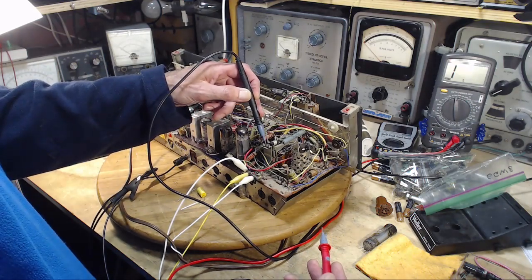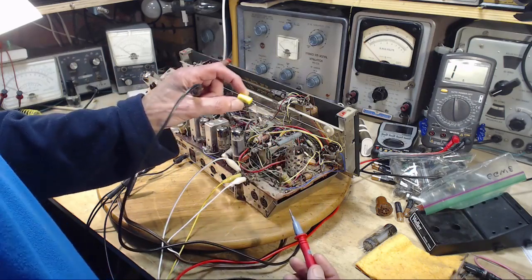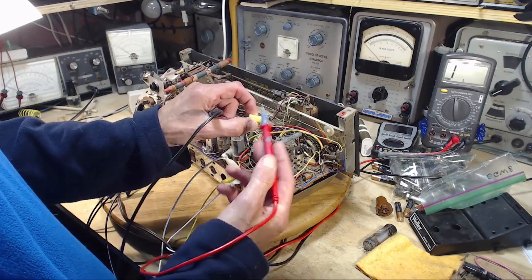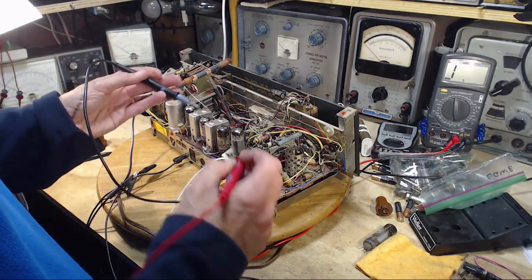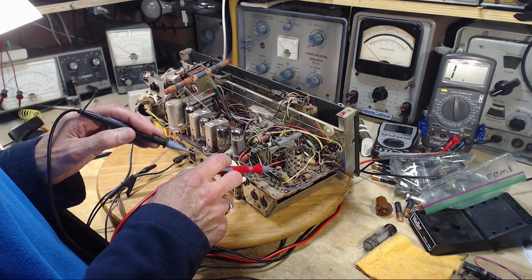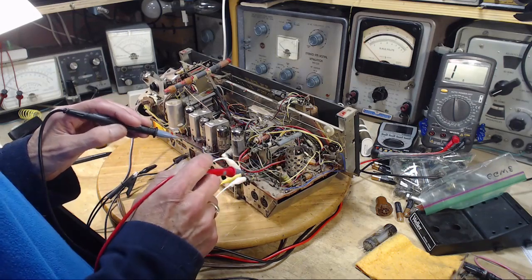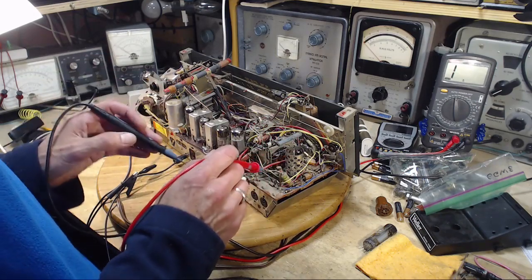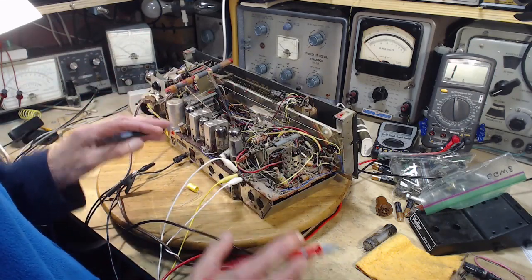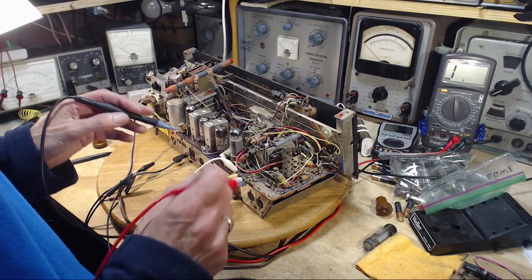So, I have pretty good capacitors, like this. Now the rating on it is 600, 630. How much you want to bet you can put this in where it says 1,000 and there's really no problem at all. These are probably good for a lot higher. But I don't know. And then along with staring at this and this, I can't help but stare at this capacitor and a few others like it where the end has kind of lifted off the capacitor. So it may just physically look like one that should be changed. So I started thinking, maybe there's a number of easy to change parts in here that might be worth doing. Obviously, one, two, three, and maybe that.